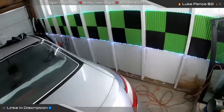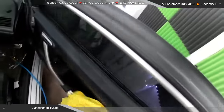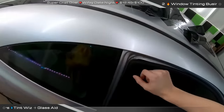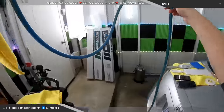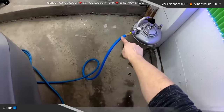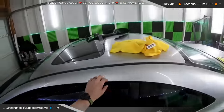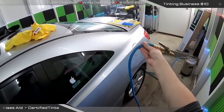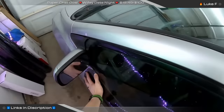Where do you get that hose? That's a new blue-style hose from SundistributingDirect.com or TintKeg.com. We were all using the Flexzilla hose and I was a big fan, but after about a year and a half it started bulging when you're adding a lot of pressure — especially with hot water — and started to leak. This one is supposed to be a little bit more durable, more rigid, and a hybrid hose so there shouldn't be any buildup. At 80-90 PSI it works really well.